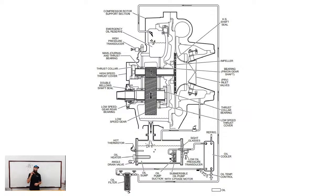Anyway, that is where you really see a machine like the YK draw its benefit, in those types of climates, because they can manipulate the water in ways that something like a Trane couldn't, and it really gets the efficiency back out of them.